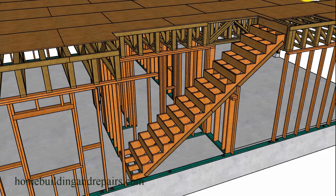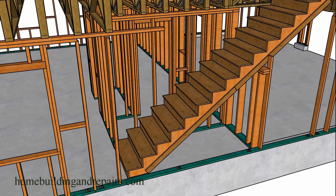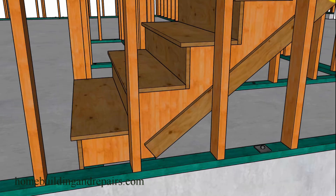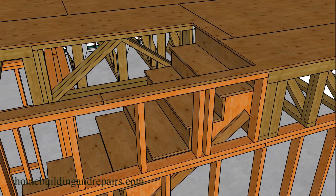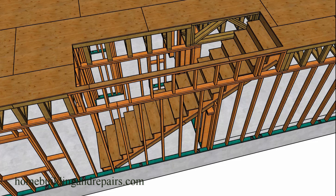We're putting our risers on — using three-quarter inch plywood for both risers and treads. Here you can see the overhang: one-inch nosing. And you can see why we had to set the stairs back a little bit to have the step line up with the edge of the wall — that's usually how the architect draws it. We have our one-inch overhang on the floor sheathing, and that is it for this video. I will put a link here at the end to the next video when it is made.